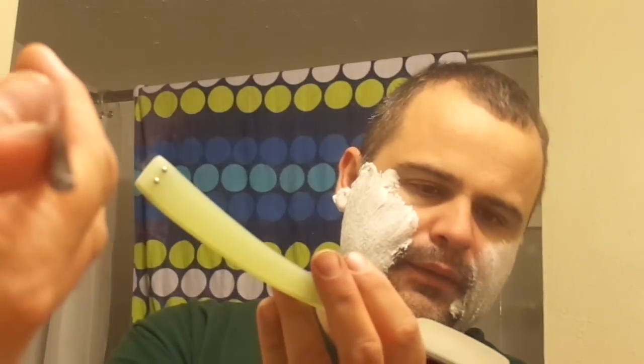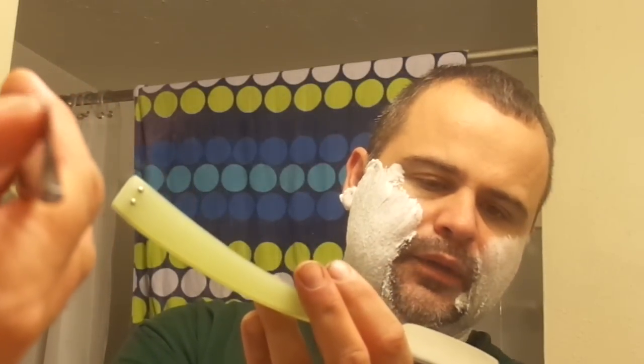There are a lot of different kinds of western razors. The one thing they have in common is that they have a pivot here. With the exception of the microtomes, all western razors are evenly ground — the same amount is hollowed out on both sides. A Japanese Kamisori has one side more hollowed out than the other, and I'll show that in a little bit.